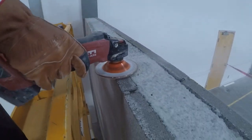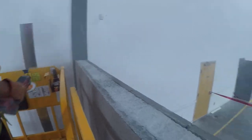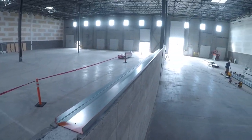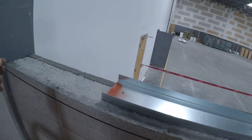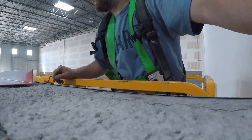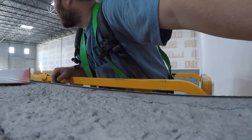Right now we're scarifying the CMU. The CMU is the gray block — concrete masonry unit — and it's concrete filled. We're just making it flat because, especially with heavy gauge, it doesn't bend or play nice with bumps. We're doing a layout. Just chalk your lines; we're always using black chalk if we can on this — you can see it really well.